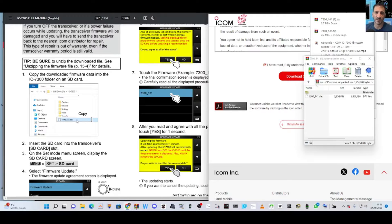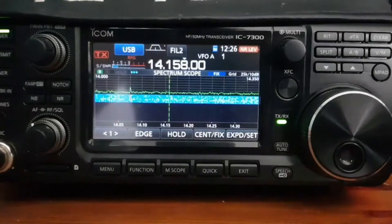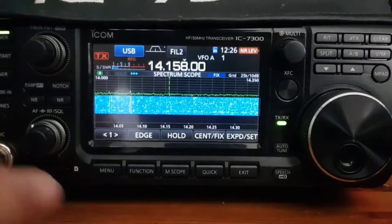On the left-hand side, with your SD card plugged into your PC, put the downloaded file into the folder that you took out of the ICOM 7300. Remember, you'll have needed to save to the SD card at least once on your 7300 to have all the files you need. Put it in there, then move on to the next part.